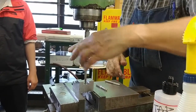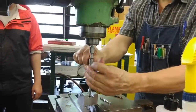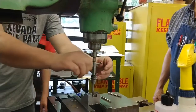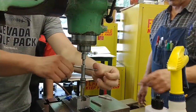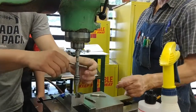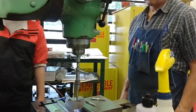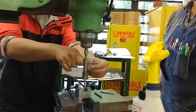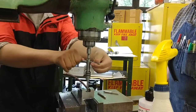It's not much easier, but it's a little easier, if you can feel it. This is dead sharp. This is brand new. It's kind of a quarter turn. Yeah, that's easy. So this tap is still okay. It's still cutting the side, but it's on its way out. Okay, let somebody else have a turn now. Feel that? Cuts a little bit easier.